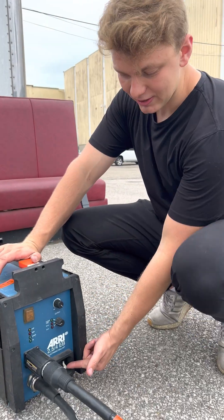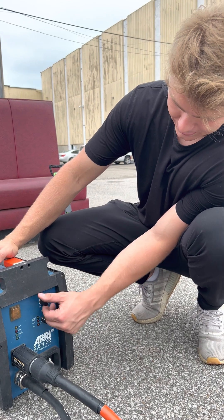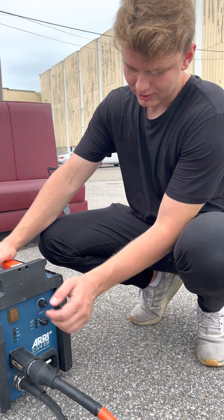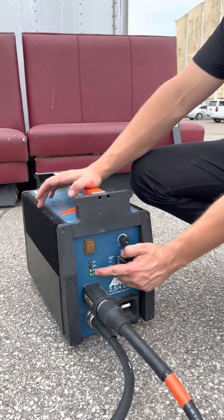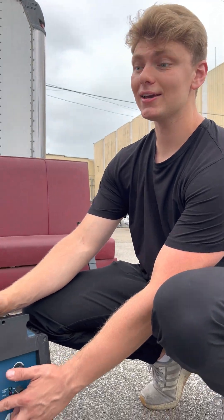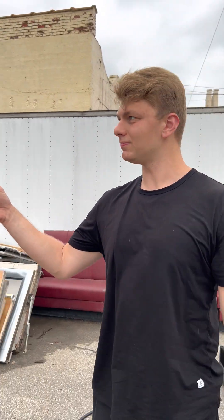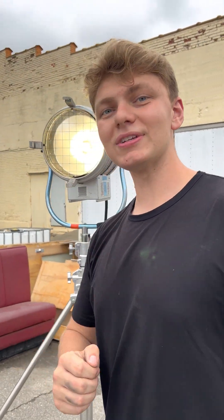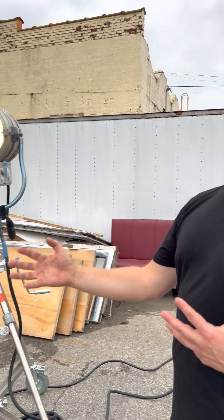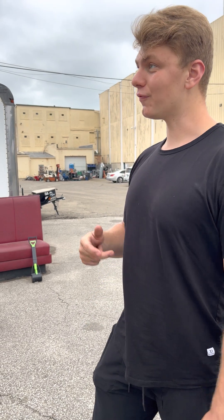So, striking the unit: the ballast should always be off — right down here, that's your off. Generators running, we're at flicker free and we're at max. We're gonna turn it on — you're gonna see these little lights come on here. When those are on, okay great. Now before you strike the light, you say 'striking.' Push it — this little thing's gonna glow — then we're gonna come over here and inspect the bulb. Turned on, we're gonna say 'good strike' over the radio, so our gaffer or whoever knows that we in fact had a good strike. Over time this is going to get extremely hot, so make sure you have gloves at all times when running around with a 4K.